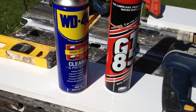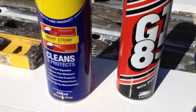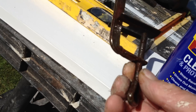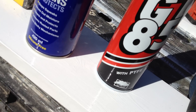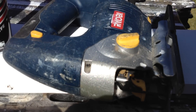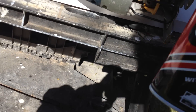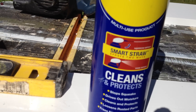Short video on when to use WD-40 and when to use GT-85. WD-40 is good for things like rust — for treating rust on stuff that doesn't actually move that much. If I wanted to spray inside my saw here, I'd use GT-85, because GT-85 is a lubricant. WD-40 is a penetrant — it's actually the opposite of a lubricant.